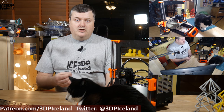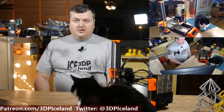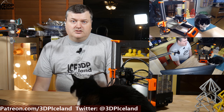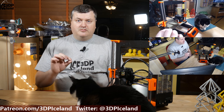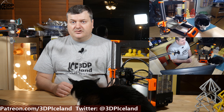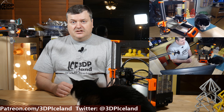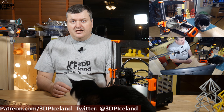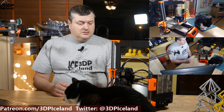It will pick up the heat on the hot end area and the Pinda Probe and adjust the temperature sensing, so the nozzle will be in the correct place from the print bed and is not dependent on the temperature as with the Prusa MK2 printer. I was having small difficulties adjusting when printing from ABS to PLA, having to readjust the Live Z settings. So that is a good feature.